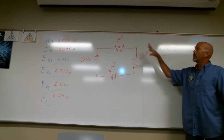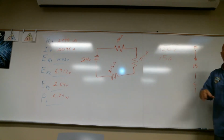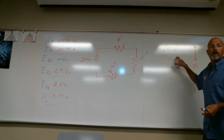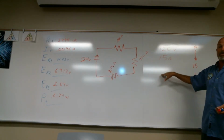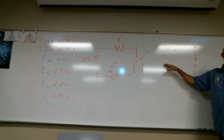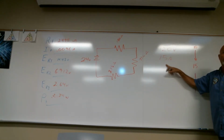So what I'm teaching are all the relations. I'm not teaching you any one thing; there are a lot of different things. I can tell how long a battery is going to last. I can tell what type of circuit breaker I will need to power something. I can determine, if I have a circuit breaker, how much I can put on it. I think I said 1800. So if I get a hot water heater that is exactly 1800, I'm probably taking a risk of being right at the edge where that breaker is going to blow on me occasionally.